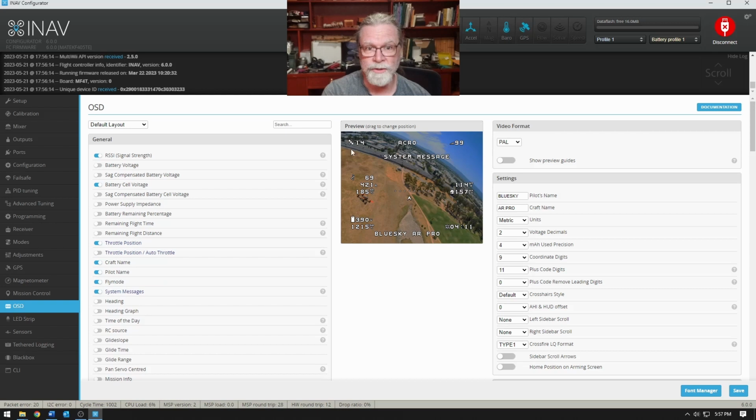What you put onto your on-screen display is in many cases very, very personal. However, for me, this is the very first time that I'm taking a wing out. So I'm going to put on some basic things that will let me have an idea of what's going on around me, but not very much. Up here, I've got the GPS satellites that are connected so I can see how many I have. On the other side, I've got my RSSI, or my radio signal strength. In the center, I've got a label telling me what flight mode I'm currently in. And then front and center, I've got system messages.